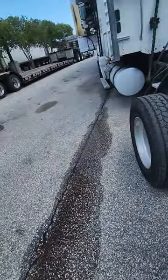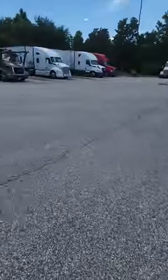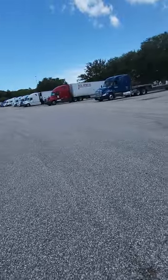The next step, which I already did, as you can tell by the trail, is drain the fluid that was already in there. This fluid was disgusting, as you could tell by the floor. The antifreeze was in there for so long that it wasn't even red. First came out clear water, and then once the water from the tank drained out, the really dirty, radiator-clogging stuff came out. It was brown and black, and you can imagine how bad it was, because I already flushed that thing once after I put the Blue Devil radiator flush in there.